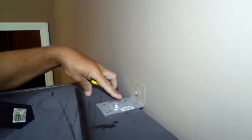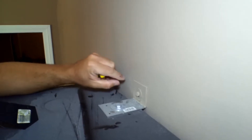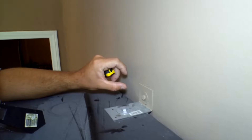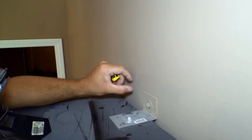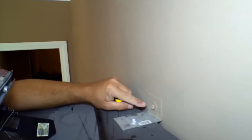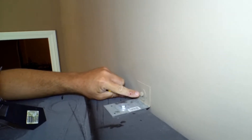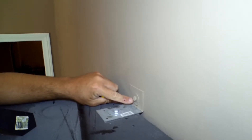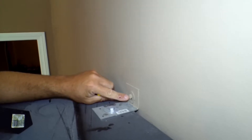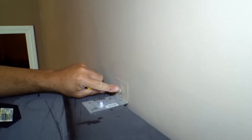What you want to get is one of these, and you want to get lag bolts. Because you've got sheetrock or plaster — I have plaster — and beyond that there's about half an inch you need to go further to get to wood. So you want to get maybe an inch long, if not longer, screw. Looking at the head here, it's about a half inch head, maybe a little bigger. The length would be about an inch to an inch and a half, and you want to get it into the stud so it can actually fasten to the wall.